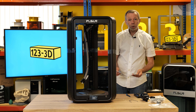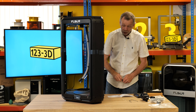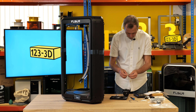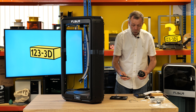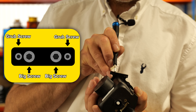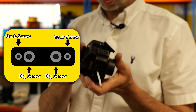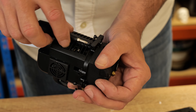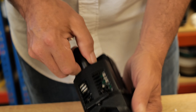Next we're going to put a million and one screws in, all by hand. We have four holes on every post, top and bottom, and we need to fill every one. It might be a good time to cut here — five minutes later. For the record: M3 grub screws, very very small. On the extruder we've got two holes on each pivot point. The inside hole is the screw, the outside hole is the grub screw — repeat on all three sides. Don't put the screws all the way in, literally two turns just to start them off. Take your time because it's very easy to cross-thread these — it's only screwing into aluminium, so make sure the threads are lined up and that the screw does not protrude into the hole.